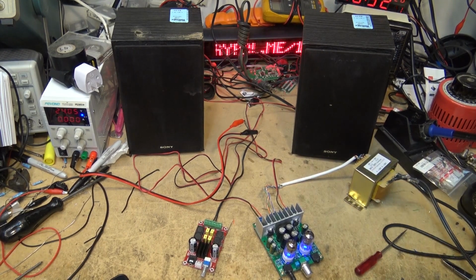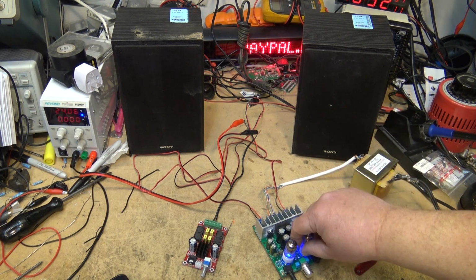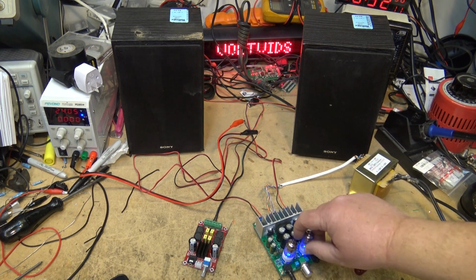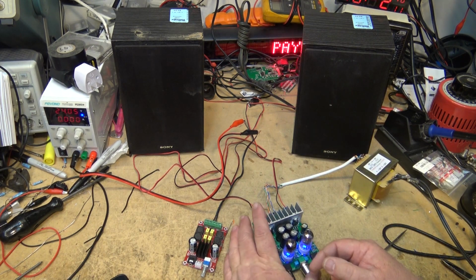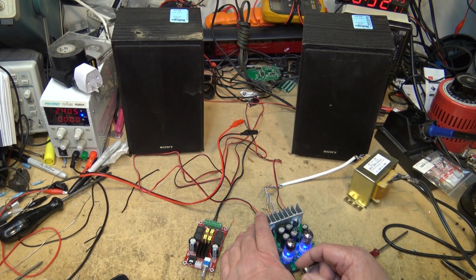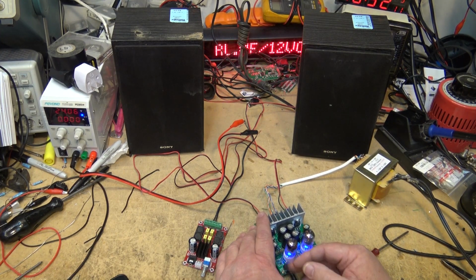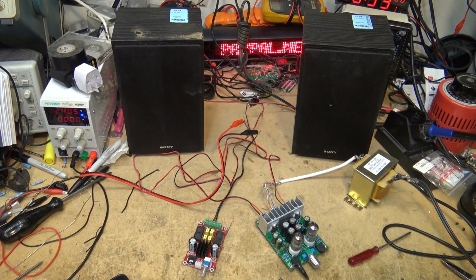One thing I will mention about tubes is that these will pick up hum. If I hang onto the tubes, they're actually amplifying noise that I'm picking up through my body. And if you bang tubes, you'll probably hear the microphonics from the internals of tubes, which is always a downside to tubes. Take a listen. You might hear a little tinging sound there. Tubes have a tendency to be microphonic.